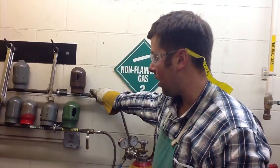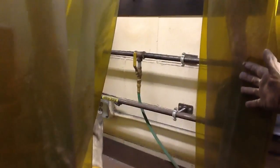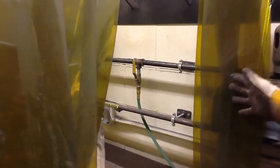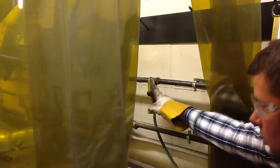Main line valve is turned on. Now the last thing I've got to do is give this thing gas as well. The top one — if you look at this, that's on right now and in line, so that means it is on; somebody left it on. This one would be off right now because it's opposite of the line. So I'm going to turn it in line. I've got gas blowing all the way down here to my TIG welder.